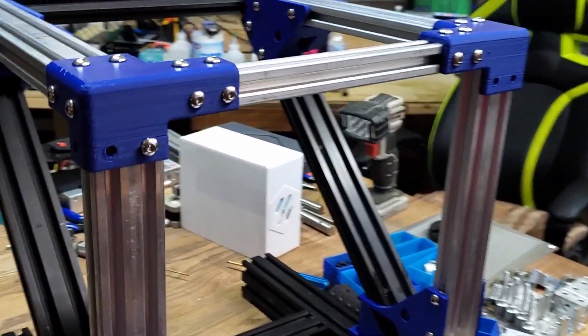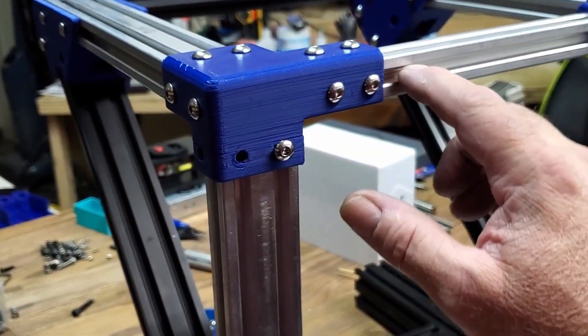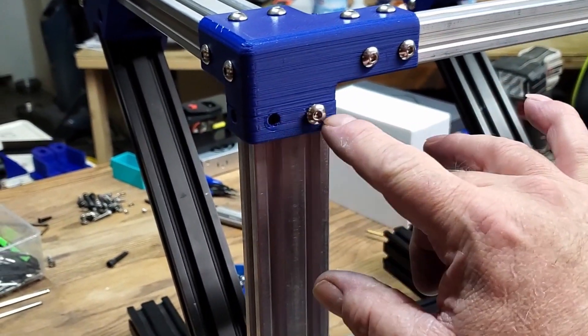Basically here's where I'm at. When I was putting these corners on — because I put all the bolts in, I had all the hammer nuts in there — the T-nuts slid together at once. You've got to kind of finagle it to get it put together. And then I wound up cracking it right across here.